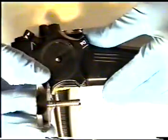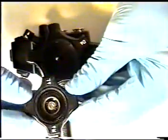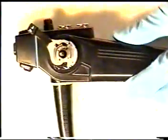We can now pull off the left-right lock knob. It should slide off. The pressure plate will fall out, but you can keep this inside the left-right knob assembly. Put the knob assembly with the other parts in reverse sequence. The up-down knob will now be able to pull off straight up the center shaft, exposing the up-down free locking mechanism. Put your up-down knob with the other parts in reverse sequence.